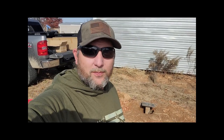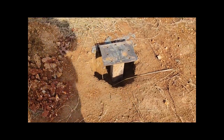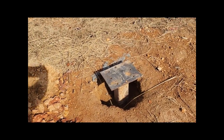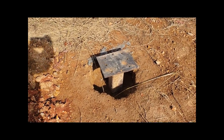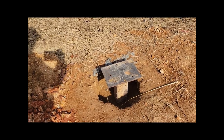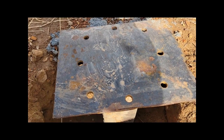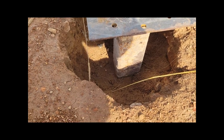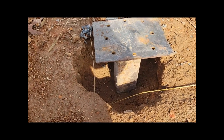I've kind of pre-installed part of this, but I'll let you know what I've done. I dug about a four-foot hole with my tractor, then I took a four-by-four piece of square tubing that's four feet long, welded a plate on top of it, drilled my holes out in it, and buried it in the ground. It's rained since I put the concrete in — I didn't fill it all the way up, but I put enough down there to hold it for sure. I can stand on it and it won't move.